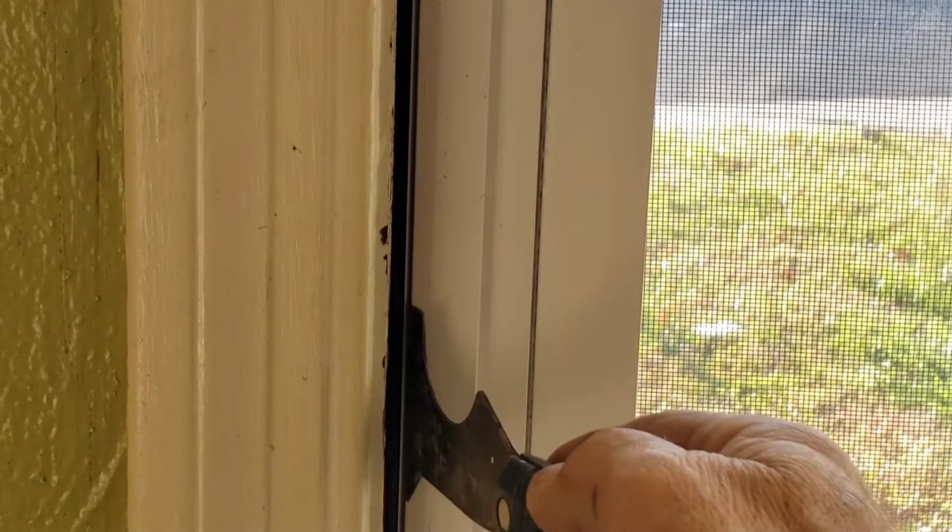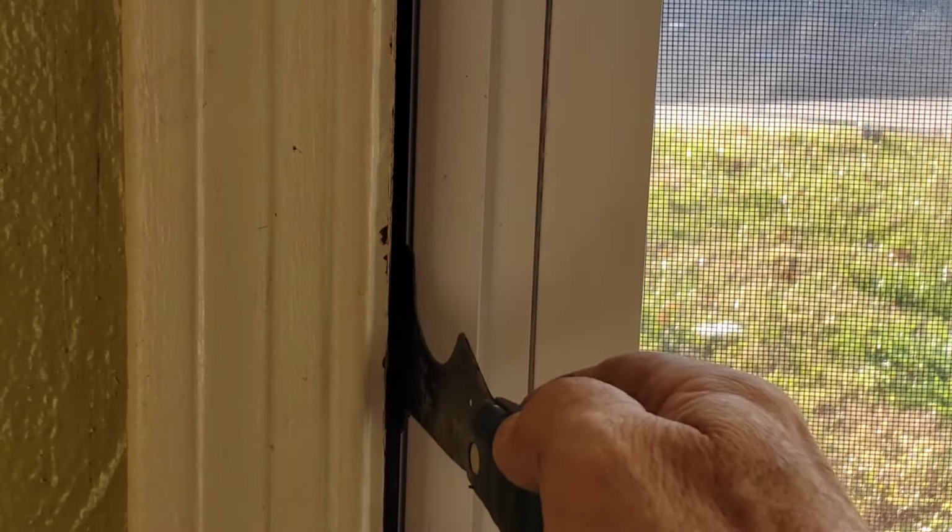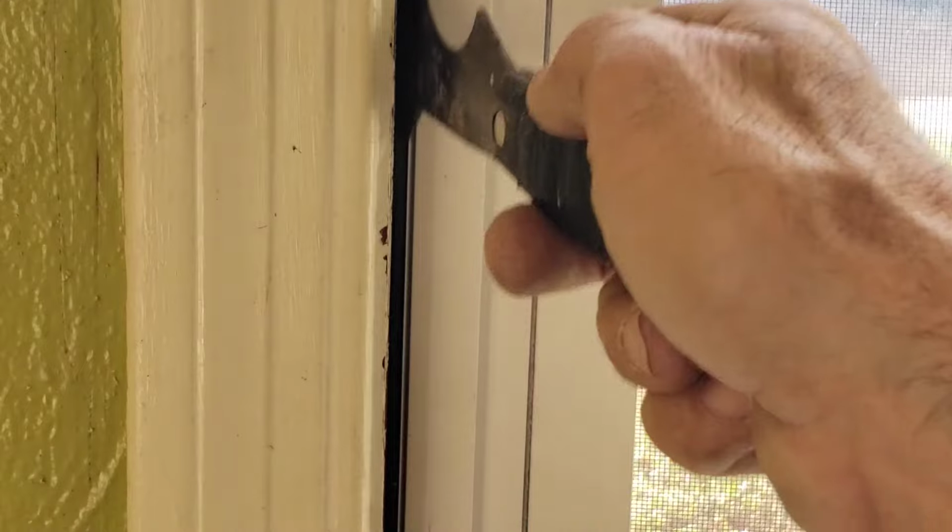I think that the big problem was at the top, so our bottom and our middle dimensions are all pretty good. You can see there's a little bit of foam that came on the window, and that's squished in there nicely. So this is a nice seal right here. What we're going to do next to seal that up, or actually to finish it off, I should say, and to kind of trap the window in there, is we're going to install the window stop back on here.